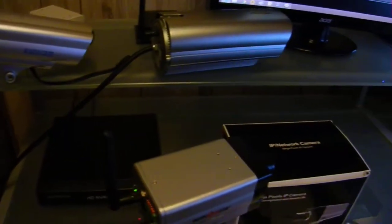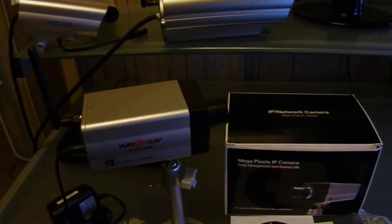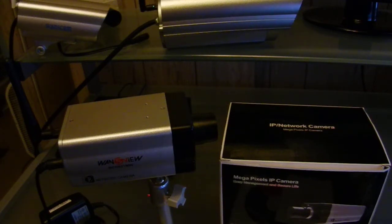This type of recording device is really great and it's a lot different from a DVR. The reason for that is you can have the NVR at a different location than where the cameras actually are. So if you have a business and all your cameras are there, in the event of a burglary or robbery, if they're looking to steal the DVR, that's not going to be possible because the NVR can be in a different location. You can wire it up to your internet at home and stream your cameras from anywhere.